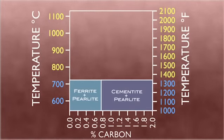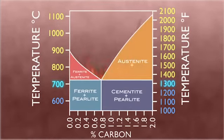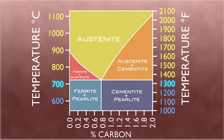Although this combination of pearlite makes for a good final product, it is not soft or workable enough to shape the steel into the knife. The steel and its atoms will need to be manipulated further. Once the steel surpasses 1335 degrees Fahrenheit, it hits the critical temperature. From this point on, the steel takes on the crystalline structure of austenite along with the possible mixtures of ferrite and cementite. Austenite is easily manipulated at extreme temperatures and resists corrosion. Of course, these are ideal conditions to shape and mold the once rigid steel. When heating the steel in the forge, reaching the austenitic phase is the goal.